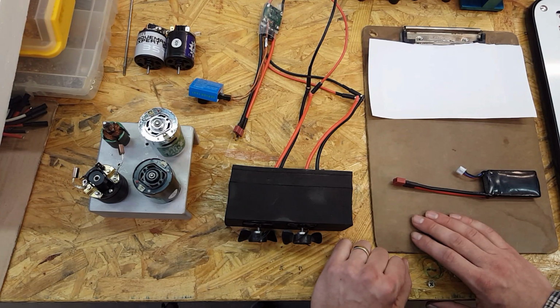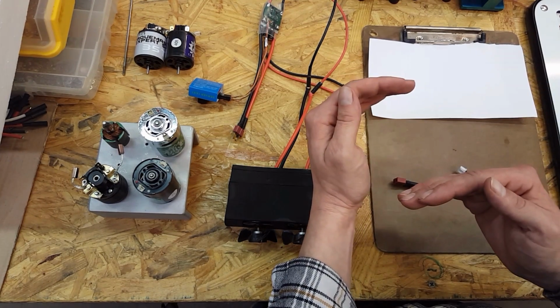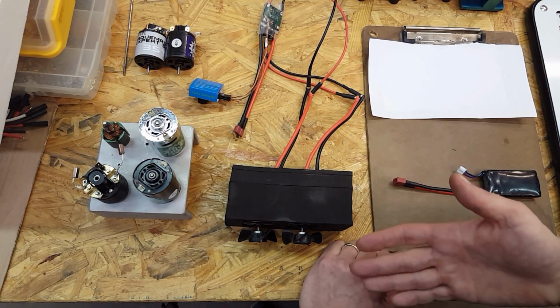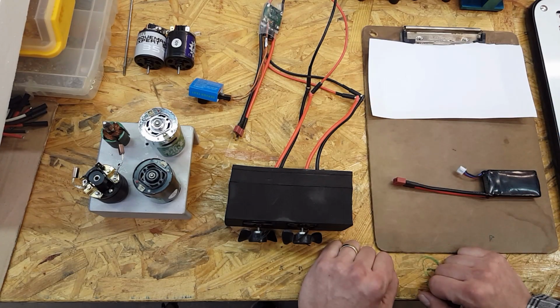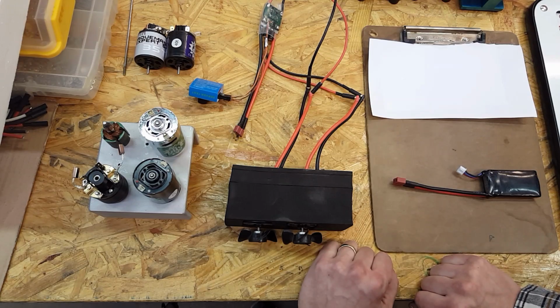You may have a reverse rotation motor in your rig if you build one custom. Let's say you have a transfer case in there beyond your transmission. Let's say you turn your transmission around backwards, or in the case of Axial rigs, you can actually build the transmission in a mirrored fashion where the motor plate sits on the opposite side of the transmission. So there's a lot of different ways. Actually, on the Axial Wraith, you can switch your ring and pinion to be one way or the other, so it would be left side, right side drive of the pinion on the ring gear. That also reverses rotation direction of the motor to get the rig to go forwards. So there's really a lot of reasons why you may need a reverse rotation motor or a forward rotation motor, and why you should know the difference between the two.